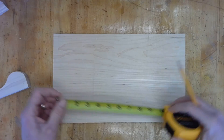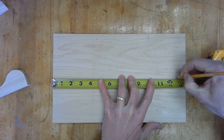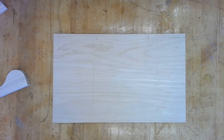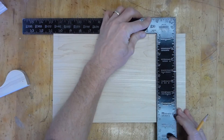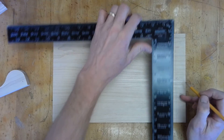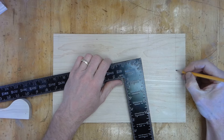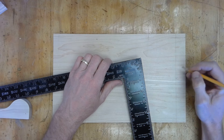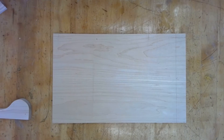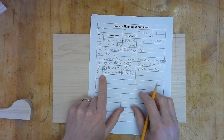So 11 plus an inch and five-eighths. We'll take the square and lay out that line. Keep in mind — I want to put the saw blade next to the line, just barely taking away a little of that pencil mark. I'd like to see a little pencil mark left and a little pencil mark as sawdust.